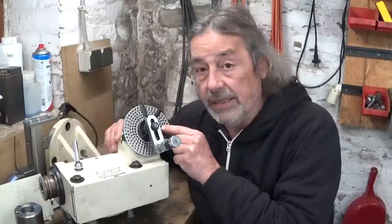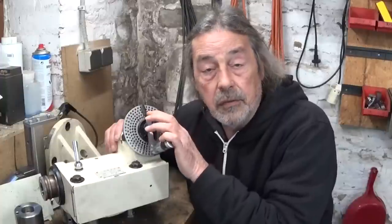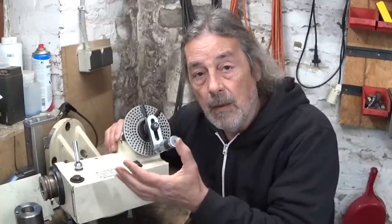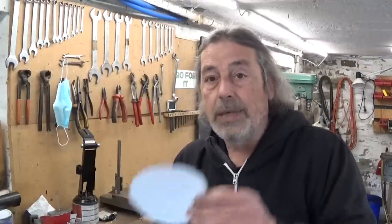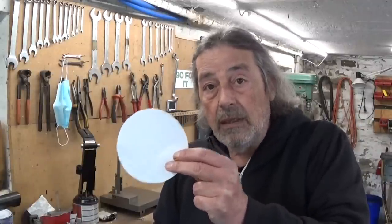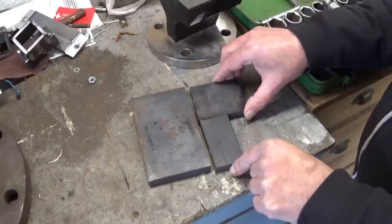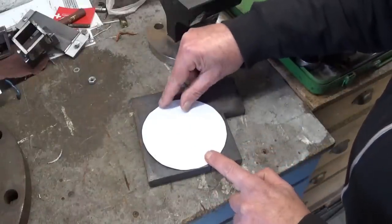With the plate I have here, and this is the only one I have, I cannot make 54 divisions. So, change of plans. I try to find different combinations, see what is possible with the gears I have and the gears I maybe could make, but nothing really works as I want it to. So I made a paper template of an 80 teeth gear. And my first idea was to puzzle it here on these three little pieces and then weld them together.